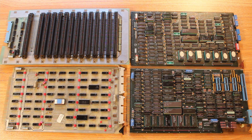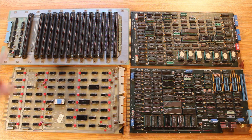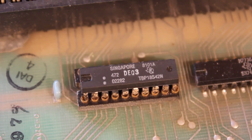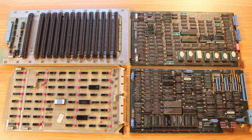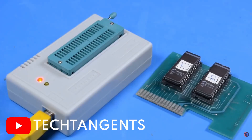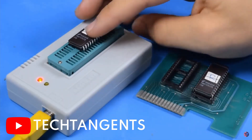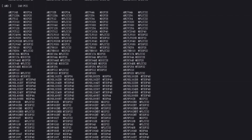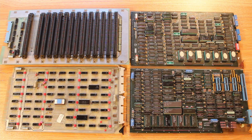There are actually some much smaller ROMs — physically smaller chips — that threw me for a loop at first. For example, this small chip up here on the backplane is actually a ROM. The best way to get the data off these ROMs is to use a ROM programmer. The most recommended one I see is the TL866, but looking at its device compatibility list, none of the ROMs I needed to dump were supported, so the TL866 was out of the question.